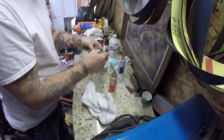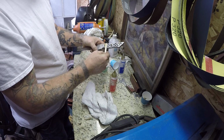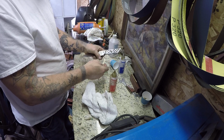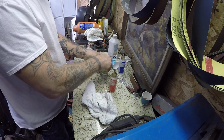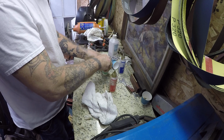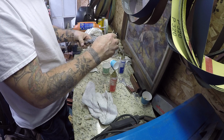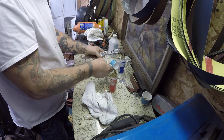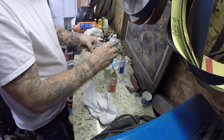I made the mistake of, when I first started making knives, not paying attention to the epoxy I had, and of course it was the 5-minute setup time stuff, and yeah, I was in for a rude awakening on that, because that stuff was setting up quick. And sometimes if you have the wrong mixture, this stuff will warm up too. She'll get a little warm on you.